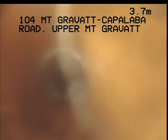No, I'm unable to work it around that junction. The junction, it is square as far as I can tell. It's not swept, so it's a bit tricky to get around. But I'll try jetting it first in case there is a root intrusion causing the issue, and then I'll see if I can work further through again.